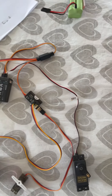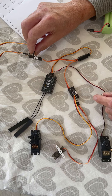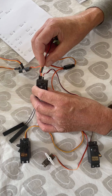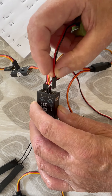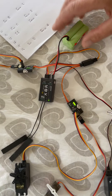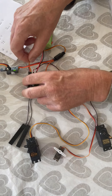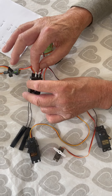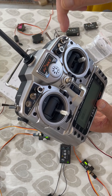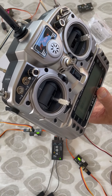Just to show you they work — I've programmed the ones as I showed you on the mixer. I'm using 16 and 13, and 10 and 12. I'll now put some power to the receiver. Although it doesn't actually matter on this one with the three-pin plug, because if you put it the wrong way around all it does is put a negative line down the signal line, which doesn't really hurt it — it's the other one I did wrong, and as you'll see later I fried one. You can see that the receivers are all on, everything is working, the S-Bus is live — that's all coming down this one cable. I've only got one servo actually connected to the receiver, nothing else, and a battery. I've programmed the switches — I've got the four top switches programmed for the servos, and I've got one of the rotating knobs also programmed to show you that you can program anything through the S-Bus.